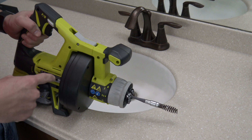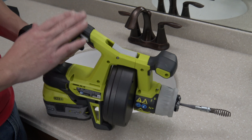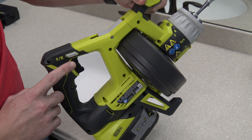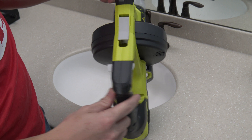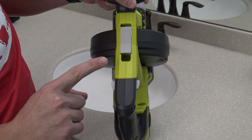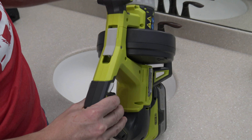This is a pro-level tool with more features and complexity than most drain augers. The trigger actually has three settings: on one side is 'N' for neutral, on the other is 'FR' for forward and retract. You can push all the way to one side to activate forward/reverse, or all the way to the other for neutral. The middle position locks the trigger, so you can safely adjust the feed collar without accidentally engaging the auger.